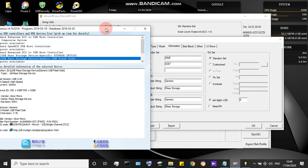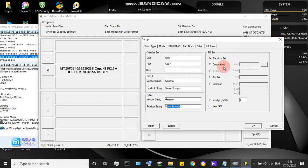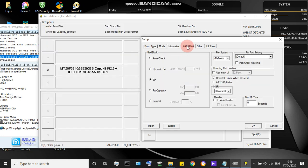These values will be shown in the Chip Genius application. The VID is 058F, the PID is shown there, the vendor's name or manufacturer's name of the microcontroller is Alcor Micro, and the CTL number is shown. You have to type the VID, PID, vendor string, and product name into the corresponding fields.